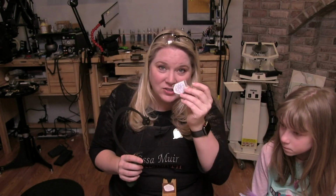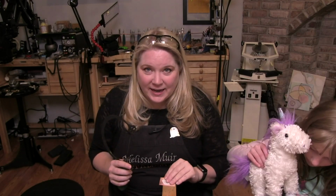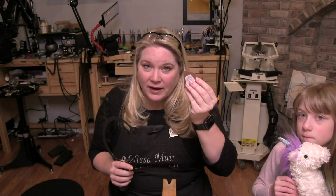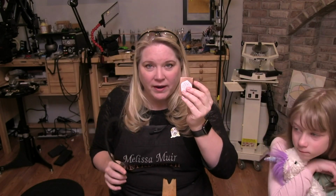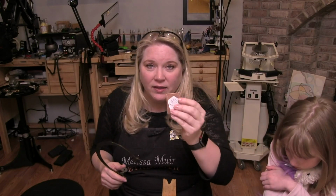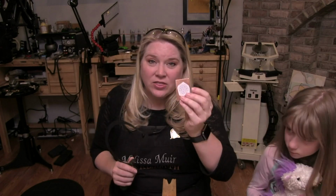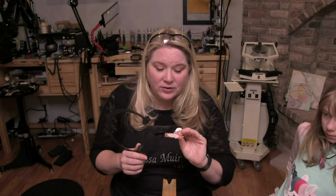Because I do actually cut a lot of more intricate pieces, my preferred saw blade size is a 5/0. Most people will prefer a 2 or 3/0. Now this is 18 gauge, so I really should be cutting easily with a 2 or a 3/0. And there's a lot of different charts that are out there, and I'll try to remember to link one down in the description for you. But anyway, that's kind of what you want to look for.